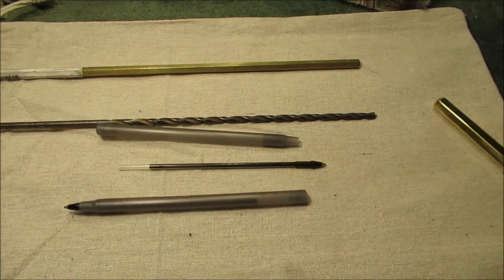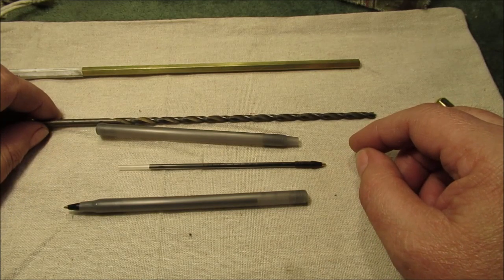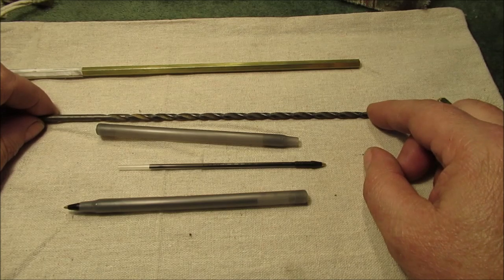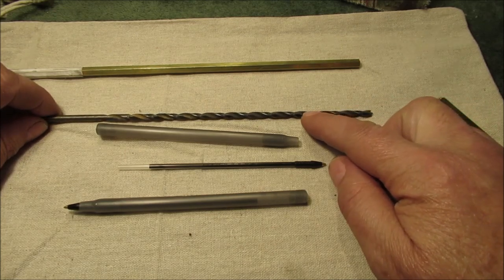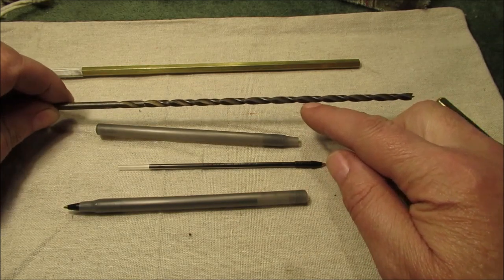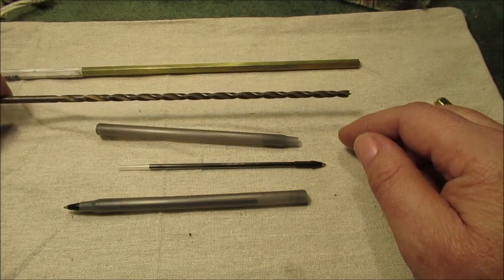So we'll get going. I'll show you just a very few pictures at the lathe, maybe when I set up and I'm ready to drill, of how tight it is to get in on that lathe to do anything. We'll start the hole with a 1/8 inch bit. Then we may have to freehand the 3/16 bit in the cordless drill or something until we can get down to where we'll put it in the vise and finish drilling it with this. And of course, we'll have masking tape on it, so we only drill so far in.